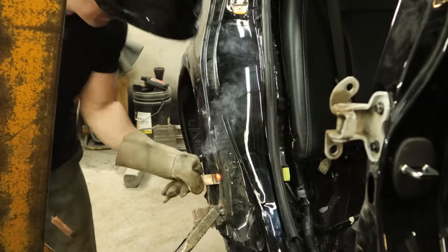I'm going to play body man for a little bit — we're going to hammer and dolly this wheelhouse to get the curve back in it and get it straight where it's supposed to be straight. I spent a little time straightening it; not going to hurt anything to straighten out the little wrinkles. This is the important piece — that's high strength steel, and luckily the impact completely missed that piece. The wheelhouse goes all the way around; we didn't pull the quarter off. Just straightening it out is not going to hurt anything, and it's still just as strong. Now we'll just put our piece over it and make sure it all fits.